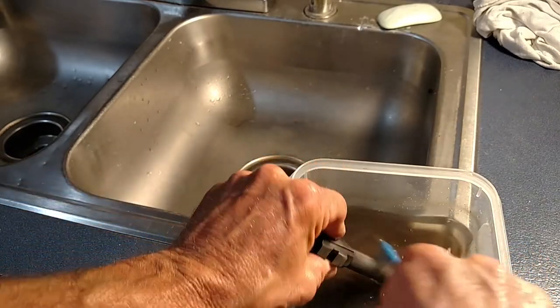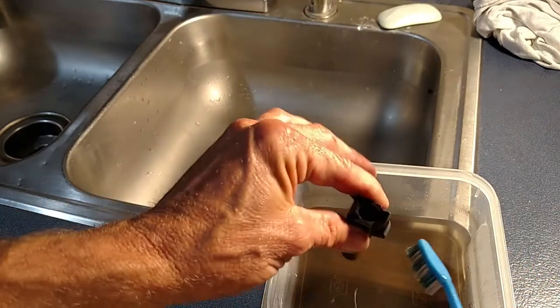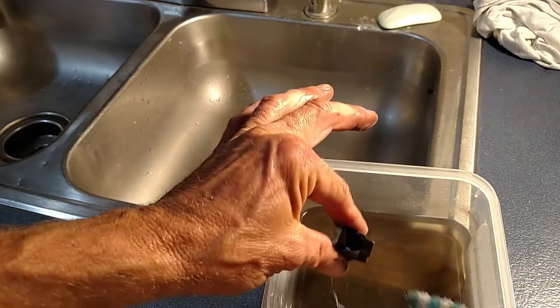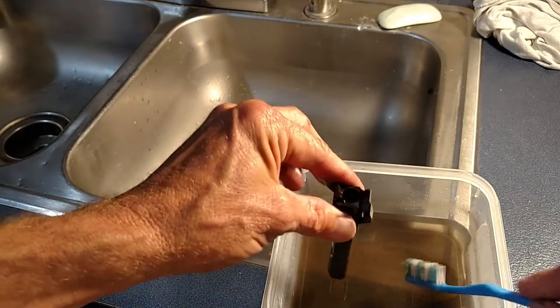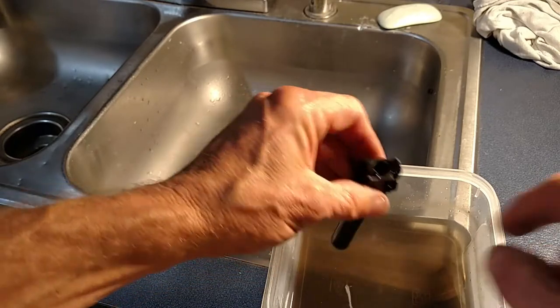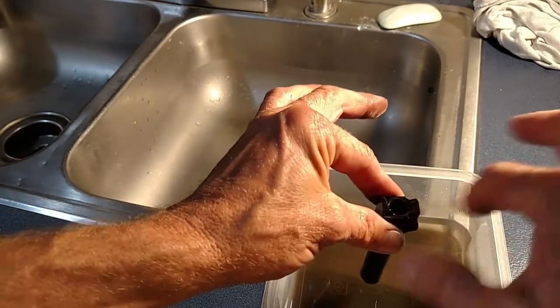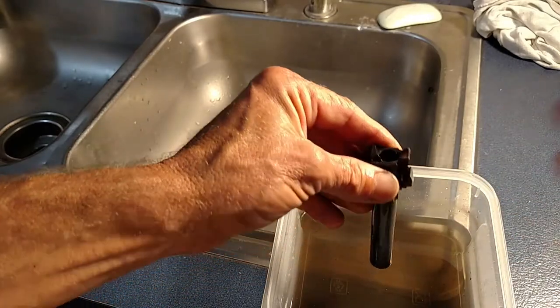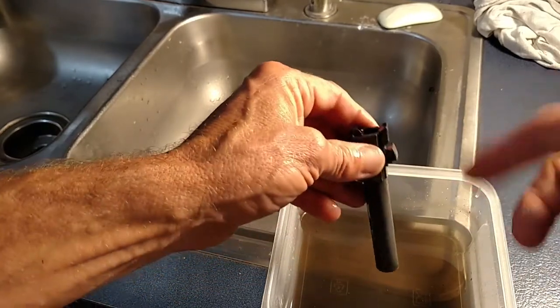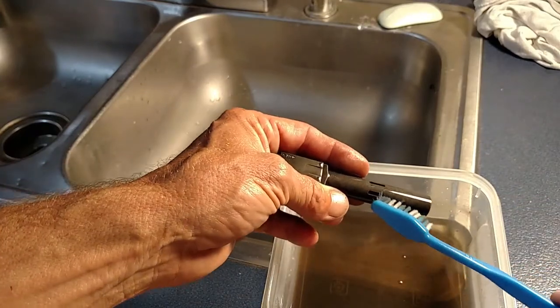And then I see other people too, they're talking about, well, what if it's doing that to the barrel, what's it doing to the inside? I really doubt it's doing anything. I did not clean the barrel before I put it in here. It had a coat of oil in it. But if you're really, really worried about it, pack the barrel with grease, Vaseline, anything to keep the vinegar from going in there. If you rub grease all through there, it's not going to get on it. But this being a slotted one, it's going to be a little bit tougher.